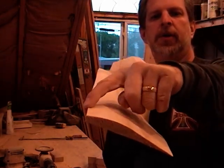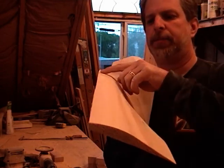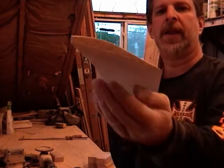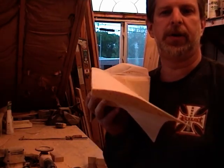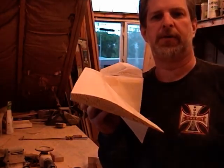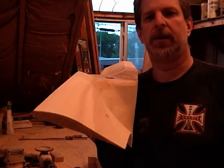The front surface will have about a half inch at the tip, feathered to about three quarters of an inch at the root, and then on the bottom surface it's a real small fillet — about an eighth of an inch at the tip and then a quarter at the root. That'll give me my final profile. I'm getting close to being able to glass, so I'll do some more sanding and I'll see you in a bit.